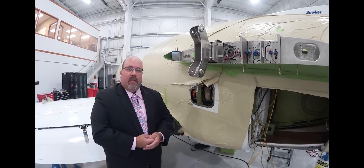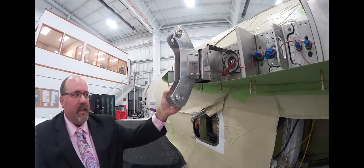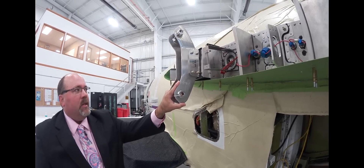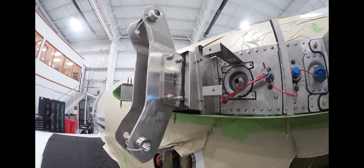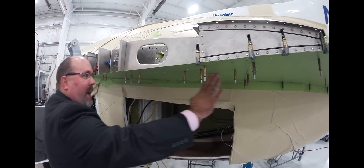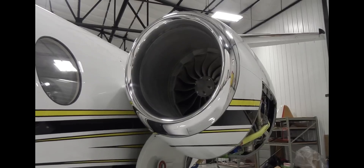During phase two, the build-up phase, the inspections are commencing on the aircraft but a lot of the main work is being done right here in the pylon, nacelle, and engine section. This mount here, built from one single piece of solid stainless steel billet milled using CNCs, is probably the most complex and certainly the most expensive machined part on the airplane. It replaces the old engine mounts which had a current AD against them requiring visual inspection for cracks. The old pylon was basically half the size of the new pylon, and all this new structure eliminates a lot of the shock wave initially caused by the original aircraft engines.